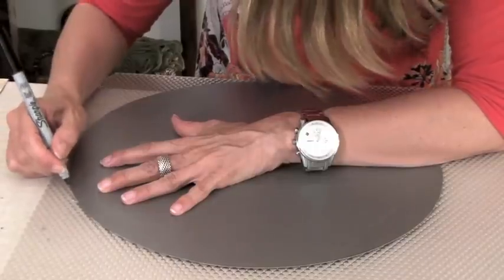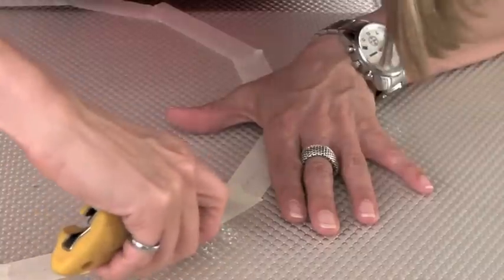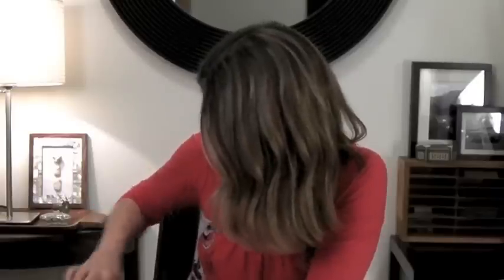Now we're ready to trace the circle — I just use a Sharpie to do that. Because this material is very brittle, it has a tendency to break apart into tiny pieces when you cut it. To prevent that from happening, put masking tape all around the outline that you just drew — that's going to minimize the problem. Then, taking a utility knife, score the line that you traced. You have to score it several times — you're not going to go through the material; the scoring just helps keep a clean edge when you're cutting with scissors. Don't skip this step — it's really your best insurance policy. Make sure you put on safety glasses before you start cutting, so you don't get any little pieces in your eyes. Use heavy-duty scissors for this because it will make things a lot easier. Now take the masking tape off. Even if the edge isn't perfect, it doesn't really matter because we won't really see the edge — it's forgiving.